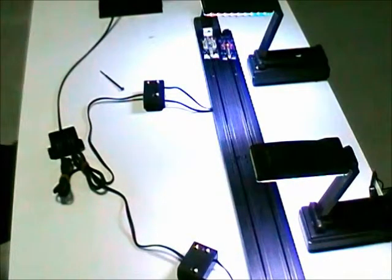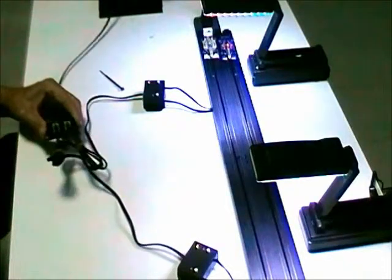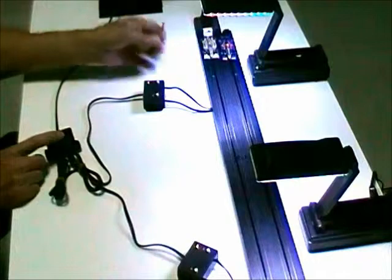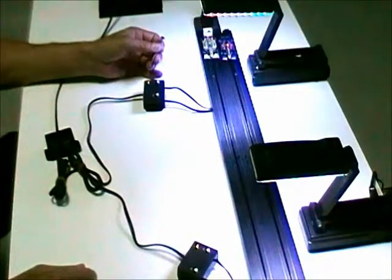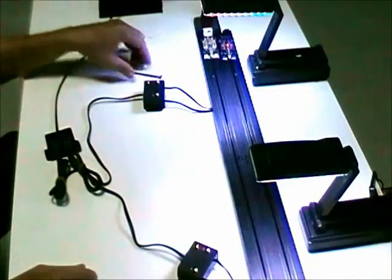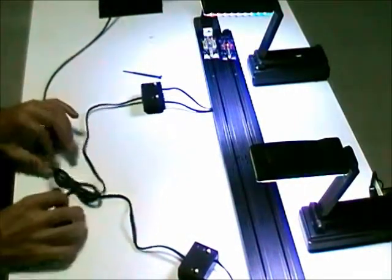Hello. What I wanted to run through today is a quick, effective way to calibrate the photo eyes in a drag strip configuration. The problem stems from when they're hooked up in tandem like that through this Y-Connect. The calibration knobs interact with each other, and so it doesn't take much effort to get one side so out of calibration that the other side can't compensate, and they end up with a frustrating situation where the LEDs won't come on at all.